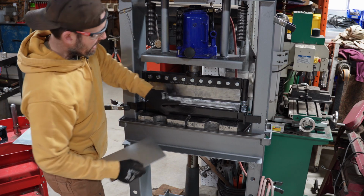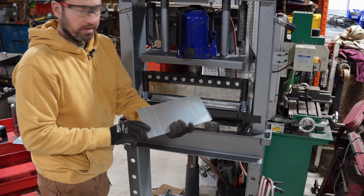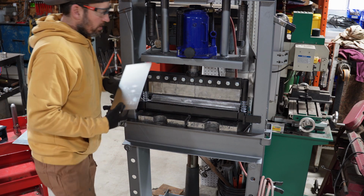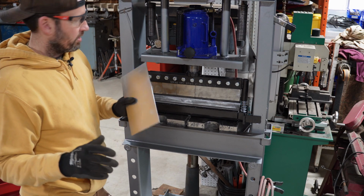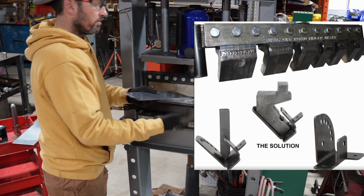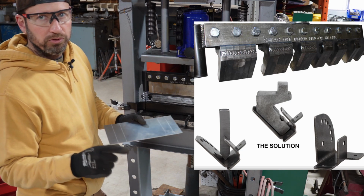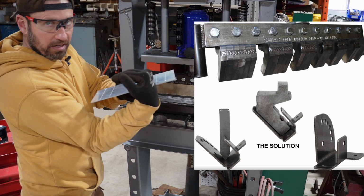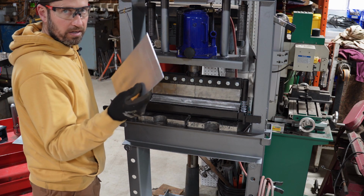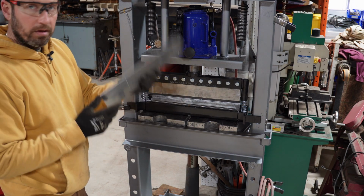So there's this stack that's right here, all of that space. This space right here makes it so that if you do have a short bend like that, let's say it was right there facing down, it can't, right? They sell what are called gooseneck dies, and I'm probably gonna have to order a pair. That would allow me to make one bend there, so bend it up, so now it's like that. Then, especially when it's a little short piece, I think at least with their kit, you can go up to almost 2 inches of a bend and then bend it in again on itself. That gooseneck die, I'll throw a little picture up here so you can see it, but that would allow me to get the bend I need out of this size. But since I don't have that, and I want this thing on the wall, I'm gonna do this right now.